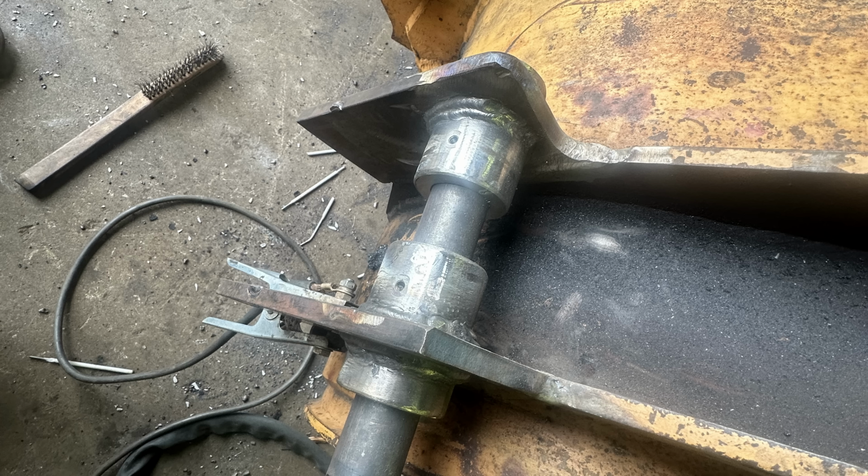I chose to stick weld this because this really isn't that critical. I more or less oversized the welds on both sides just to try and help hold those bushings straight. When everything was said and done, the pin slipped in and out just fine with no grease on it, so it turned out fine. It just was kind of a pain to weld it.